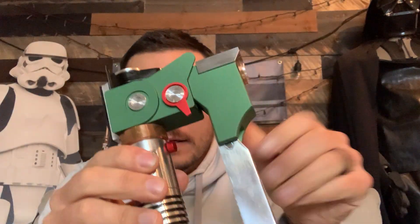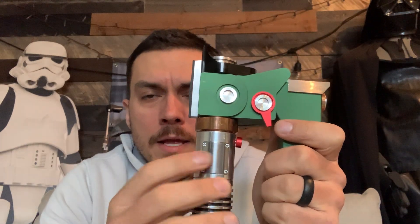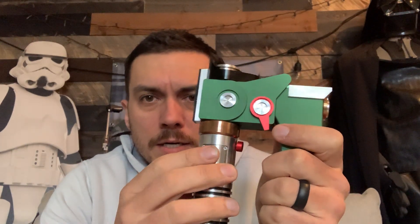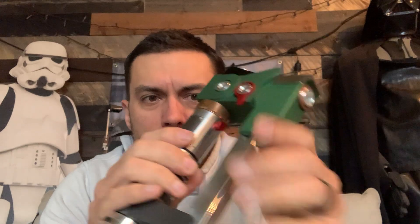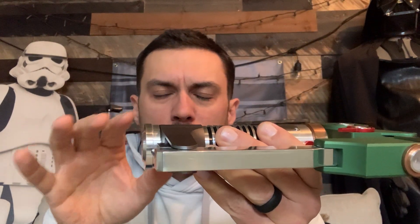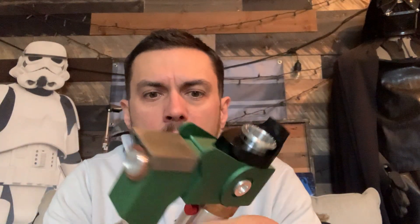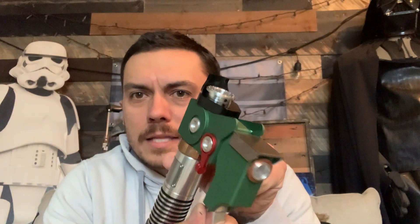This guy right here — as you might know from my last video — I don't put the recharge port here. I use this window here as a tidy-up section because when I run my wires, I run everything long enough to wire the board about right here, make sure everything works, do all my testing, and then run everything back where it should be. I'm left with a bunch of wires right here, so what I do is snip everything short, solder it together, and lay it down real neatly right here and then close this door up. You should never have to get into that door, actually.